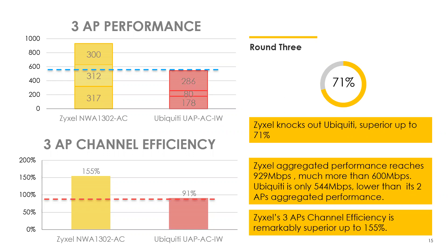Wi-Fi 6 has added technologies that help solve some of these issues — things like BSS color coding and TWT (Target Wake Time), which schedules when users broadcast to make it more efficient. But they go about it differently than smart antenna. Smart antenna can be considered a complementary technology — Wi-Fi 6 helps in one way, smart antenna helps in another. Combining them gives you a really significant performance boost.